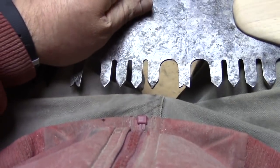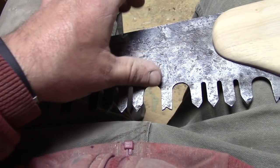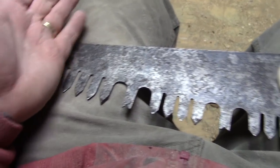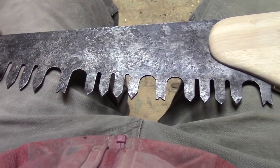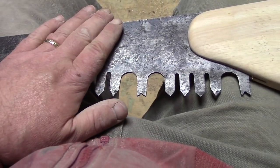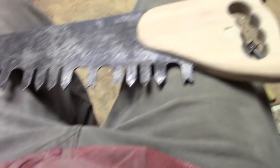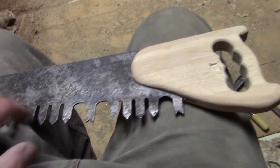And I have another blade — a blade that some students of mine, after I taught the unit on Montana logging, found way out in the woods while geocaching. It was clearly a big whipsaw, but it had been bent and broken off at both ends. So I've got about two feet of it that's straight. I thought if this worked in any way well, I might consider rehashing it, only making it two feet long — then you've got yourself a saw that might be useful. The only downside is it is so worn out, there's really nothing left of the rakers. But anything we can give new life to, right? Let's sharpen that.